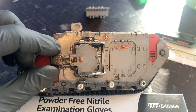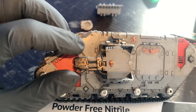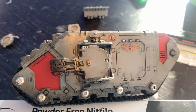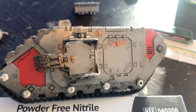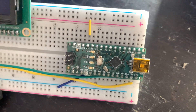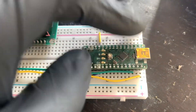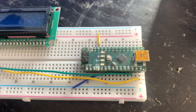Whether I lock the sponsons into the side or leave them able to rotate, I'm not sure yet. Leaving them moving does mean I can pull them out to tune the angle better — if the sensor is seeing too much of the side or is angled wrong, I can adjust it that way. I'll be using an Arduino Nano to power it all, mainly because it's small and should fit in well. I'll try to get one of those pin holders so I can just slot it in and slot wires into each side — easy to test without having to solder, then unsolder if it doesn't work.